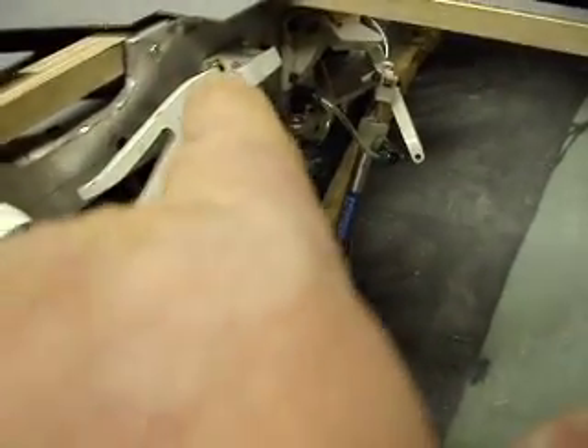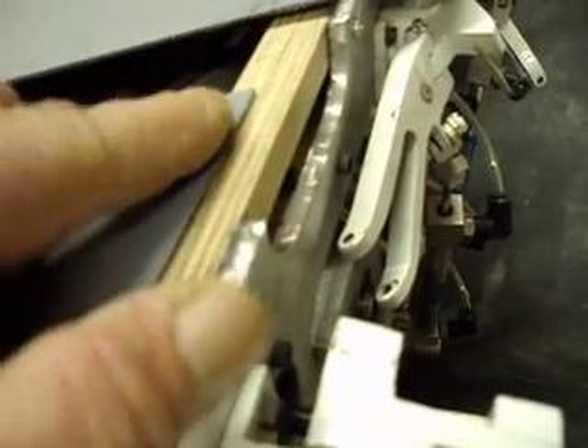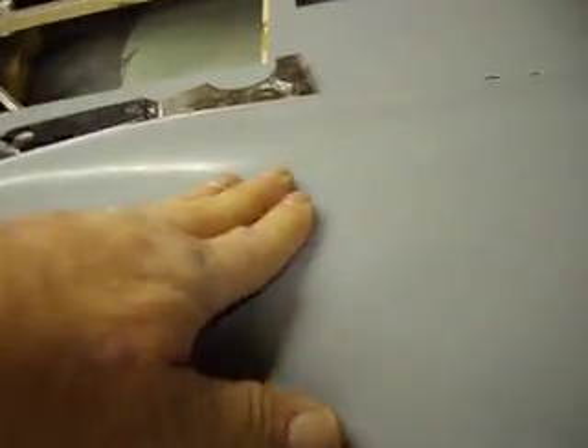I took the landing gear off to make it a little easier to work with, but I also wanted to change a few things. We were talking about putting wood on the bottom of that thing but I didn't do it - we were in a hurry to get to Breckenridge. Where these nacelles went was just kind of floppy, so what I did is put that wood on the bottom and ran it on past into that little pad. Now when I glue this all back in there it'll be solid on both sides, and I'll be able to screw that down and put some helicoil-type things in there for some machine screws - same way here on the back.